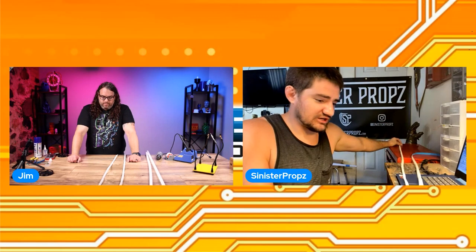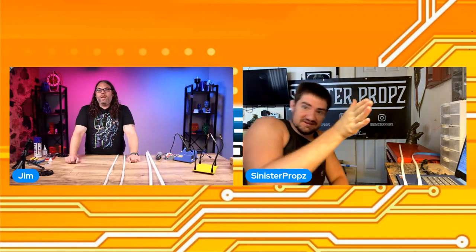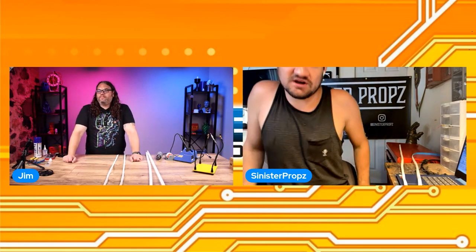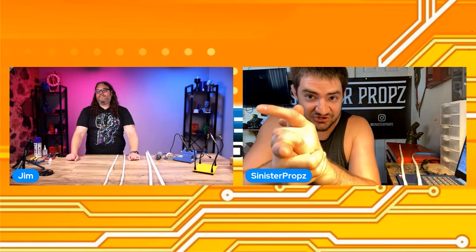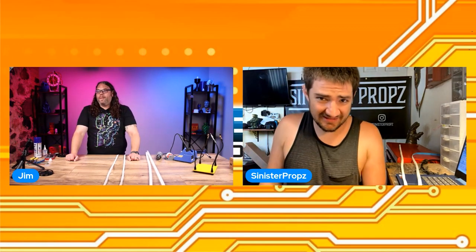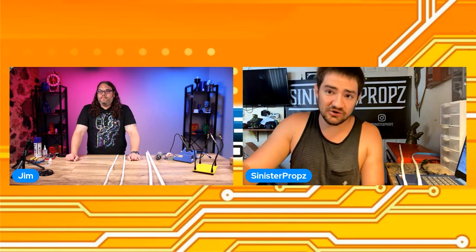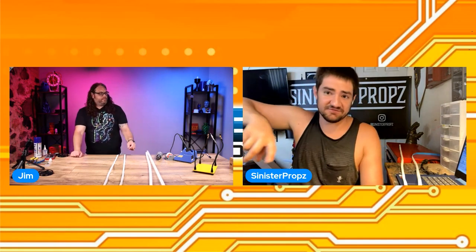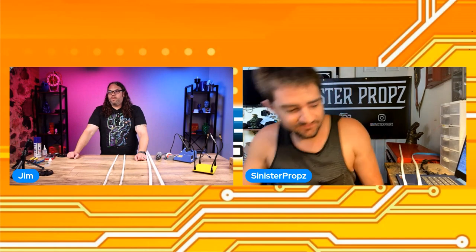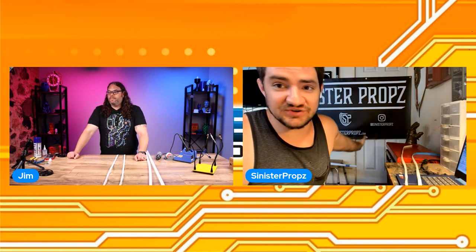Gotcha. So when we look at these two NeoPixel blades, you want the arrows flowing out, because you want the data to go that way, from the base to the end. Exactly. Funny enough, Jim, you have NeoPixel lights behind you that are lighting up the red and blue side of your cabinets. Data flows in one direction, and you'll always start the power, at least the data line, on one side. This is a great look at how that works in a very simple form, because this is just a string of NeoPixels.